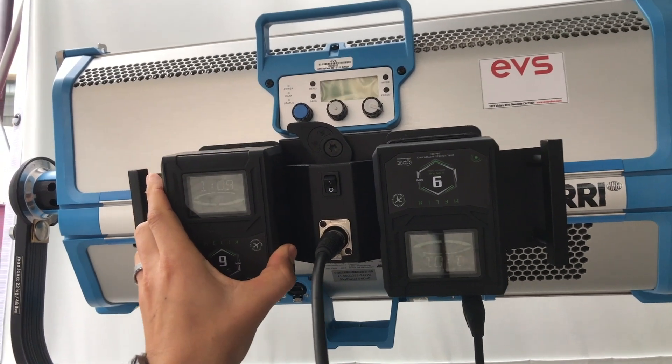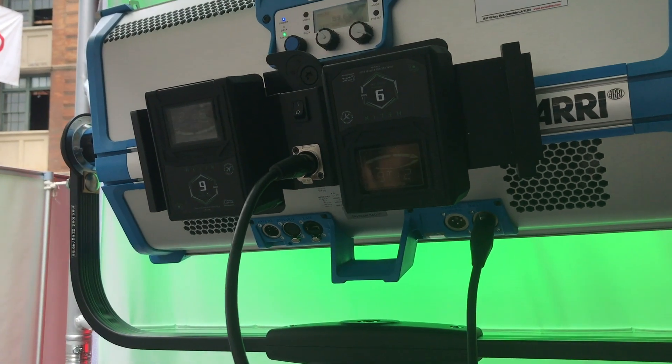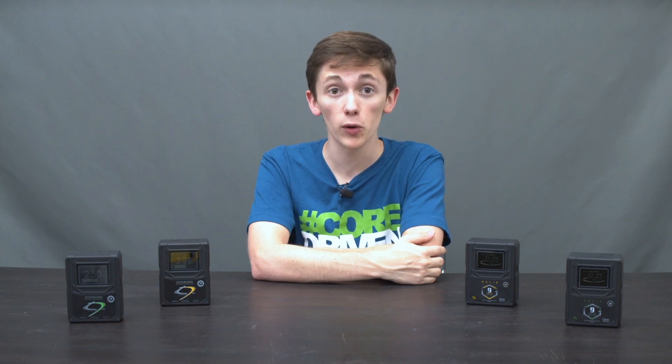Should you invest now? We've seen a huge demand for the Helix packs for lighting applications. Keep in mind that when powering high-power draw lighting at higher voltage levels, it reduces the amount of current needed from the battery. Less current means less strain and heat from the battery, which extends operational service life. We recently came out with a sky panel and a C-Stand battery bracket to better address high-power, high-voltage LED lighting applications. The advantage of using Helix in this application is that you don't need to use inefficient DC boosters, which put more wear and tear on your 14-volt packs.